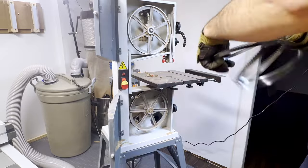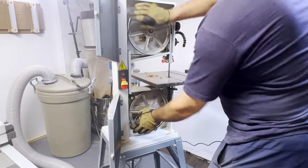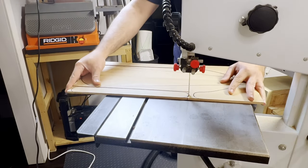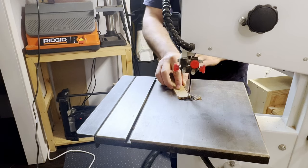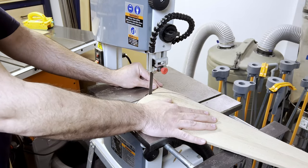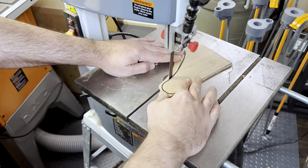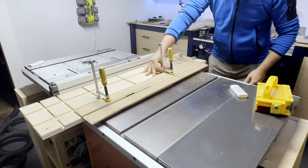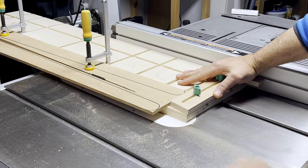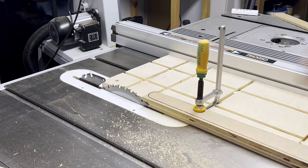Here's an important tip: when using a bandsaw or table saw, keep your blades separate. The blade I just took off was for the MDF templates, and now I'm putting on a fresh blade to cut oak. When I traced the templates onto the oak I used a Sharpie, which gives a nice thick line. As long as I keep some portion of that line still on while using the bandsaw, I know that the flush trim router bit will give a nice clean cut. One of the stars of this build was the tapering jig — I used it for the templates and for the oak wherever there's a straight line, like the torso or the leg.